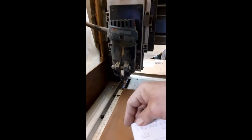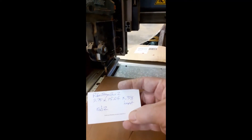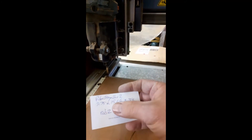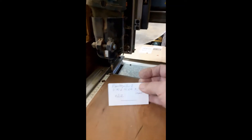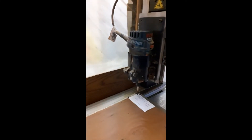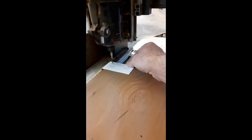How close do we want to be? I have a piece of card stock — and right here I've written down the dimensions of my piece. I know I'm going to be cutting to a maximum depth of 0.387 inches. I'm cutting an image 9.75 by 15.64 inches. I check that, and when it's just pinching the card stock, that's about right.